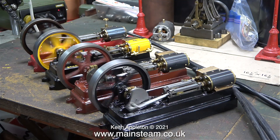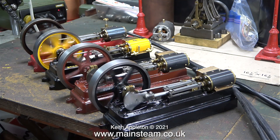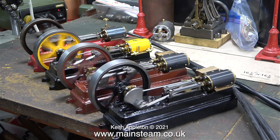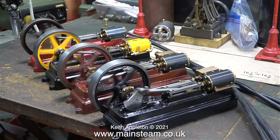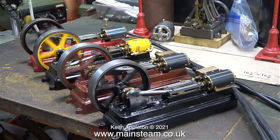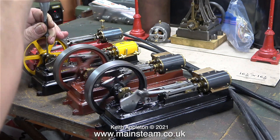If you want more details please watch the series at Stuart Model Steam Plant. The S50 in the foreground really is the best of the bunch and there is a video on my channel showing what I did to it. I fitted a piston ring, filed the crosshead to fit the crosshead guides, and set the timing — and it's running very well.